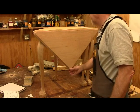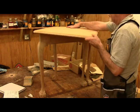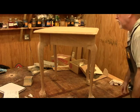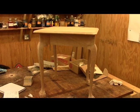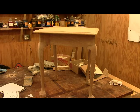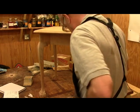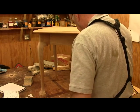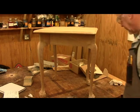We've got our baby butt corners on here, and this is about how it will look most of the time. It's not fastened to the top yet — this is still a hair tight, although I may want to leave it that way. This should come out here and support it, and you're now seeing this for the first time because I haven't done that before, but it seems to work pretty good. You can see that metal pin holding the swing leg in. Ultimately I'll put in a wooden quarter inch pin through it. It's slightly tipping, so we have to take a look at that — we wouldn't want it to rock back and forth.